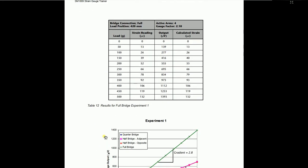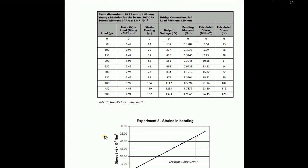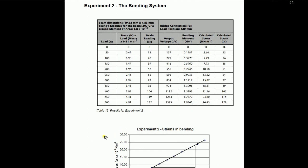Optional tension system: there are extra specimens provided that you can change to make other experiments. This is the setup to change the specimen — it is written and displayed in the user manual and you can easily find it. Now moving to the results sections. These are the readings of the torsion system. If you see negative values on the strain gauge, it means the strain gauge is measuring compressive strain. The negative sign only shows that the strain is being taken as compressive.